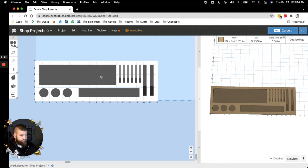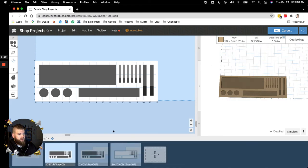Anyway, so we go back to what I would do if you bring up your storyboard or whatever you call it down here. I have 3 of them. Okay, so it's all the same, and you just duplicate, and then do your adjustments. And get in a habit of renaming them. So if you just drop it down, you can rename them. Because otherwise, when you get into the post processor on the machine, it gets very confusing. And then you have to go back and re-download and whatever.